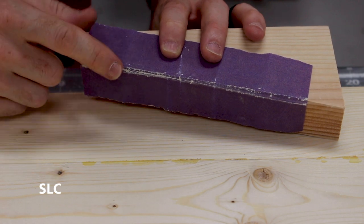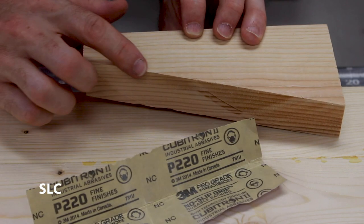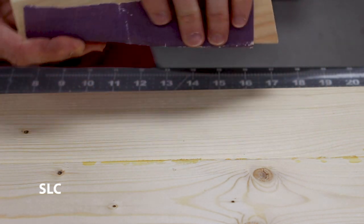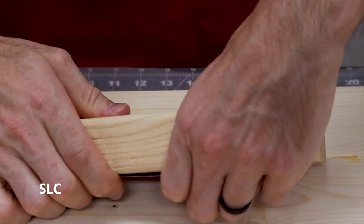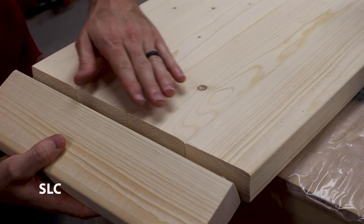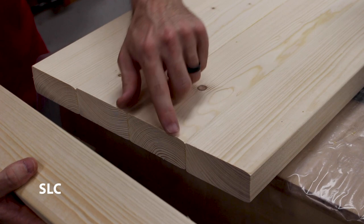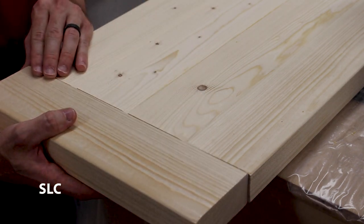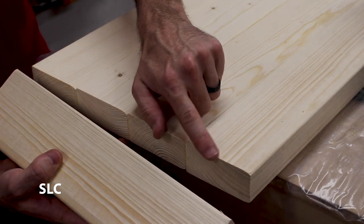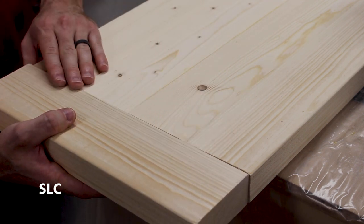To get down into these grooves I've taken a piece of sandpaper — this happens to be 220 — and I'm using it on a board that has a really sharp edge on it. I'm putting it on, creating a crease where it should go, holding it really tight and just going back and forth. Down here on the ends I'm going to need to sand this down as well — two reasons: one, less likely to get any splinters in the future, and also since I'm going to be mating this board up to it and this has a natural curve from the factory, I want this to also have that curve so it looks like a nice seam, like it is in these two joints here.